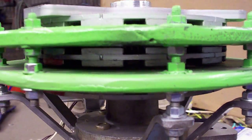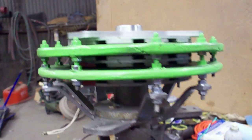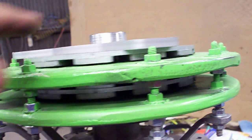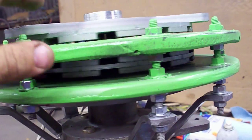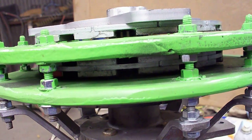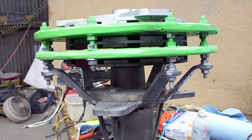The reason I did it that way is because the finer winding is a lot more sensitive for voltage, and the stronger winding gives a lot more amperage and power. I set it up with a battery so that until the generator creates the same voltage as the battery — for instance 11.5 volts — it will freewheel. I like it that way because the wind has a good chance to catch up and spin the turbine.